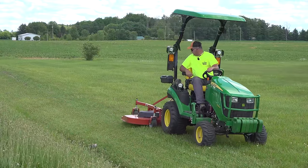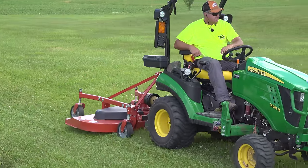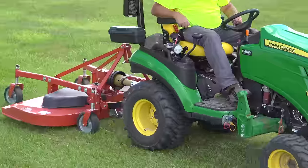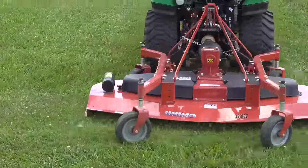You'll notice I have six 42-pound weights on the front heavy hitch bracket. With some off-camera testing, that seemed like about the right amount. Without front ballast, it was difficult to turn as the front wheels wanted to slide.